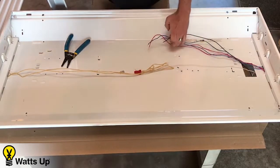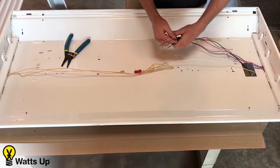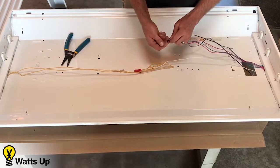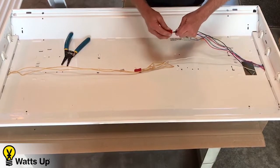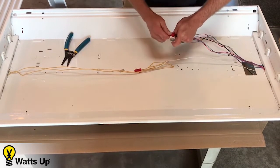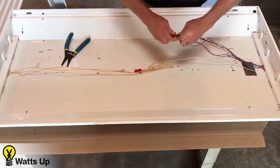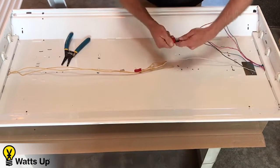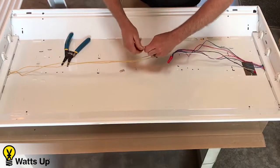Take your line wire. You want to bundle up the four wires that are going to the other end of the fixture — that's going to be the hot end. Make sure you've got a good connection and your wire nuts are twisted nice and tight so nothing's going to push out through.